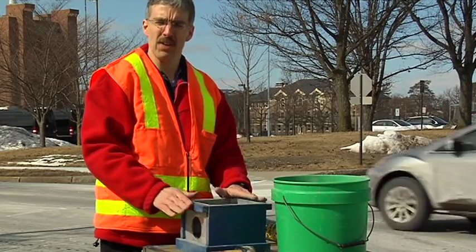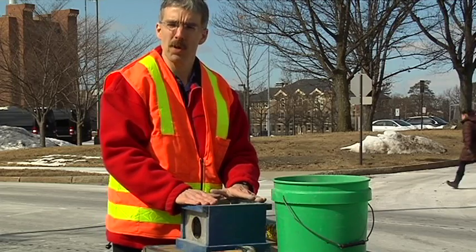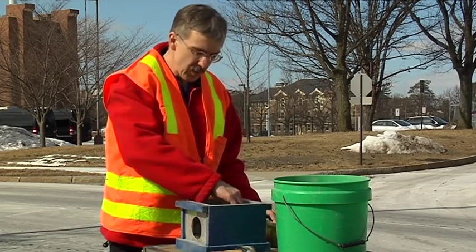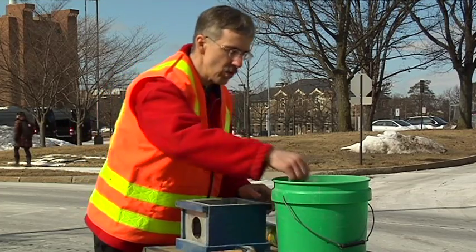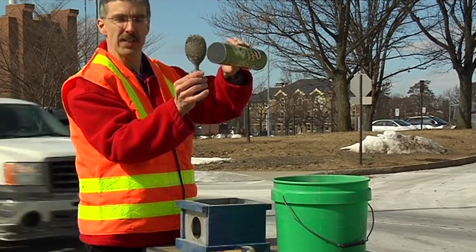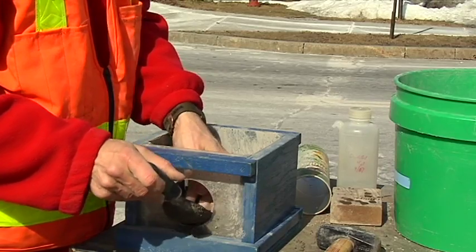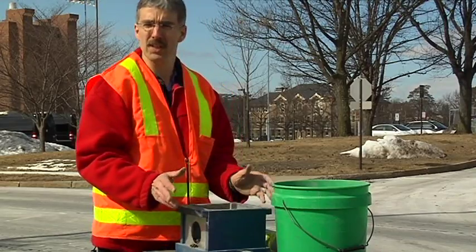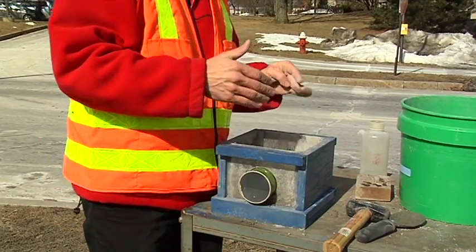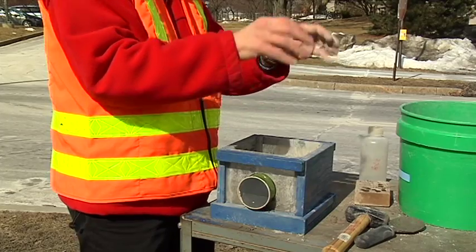Now I've put in a second lift of gravel. I'm slightly above my final elevation for my pipe — not because I'm worried about the pipe settling, but to provide a place to lay my pipe in as a haunch. I'm going to dig out a little bit of a space for that. I need something the same shape as my pipe — my little tool does that. In the real world, you could use a collar for your pipe; it's a great template to set the shape. The haunch holds the pipe in place while doing the rest of the work and helps get material underneath so you don't get a void there.